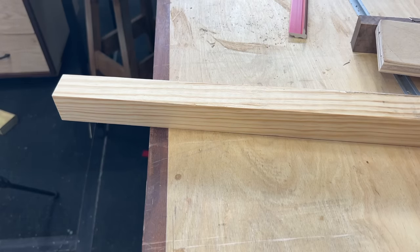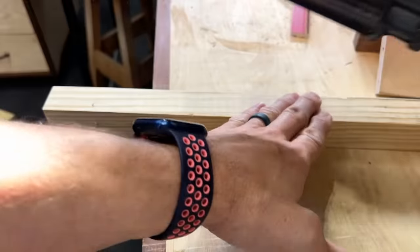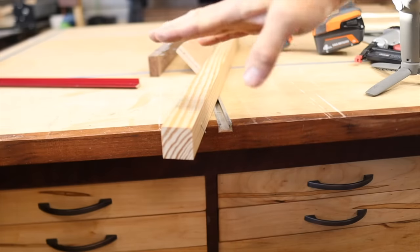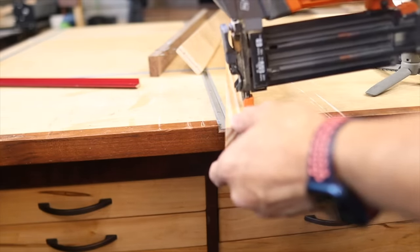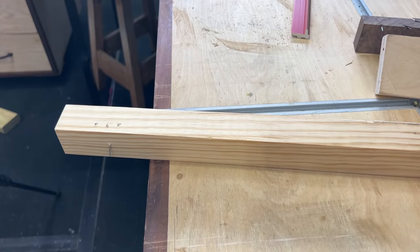So why is that important? The reason is if you're driving close to the edge of a piece of wood or trim, it can blast out the side. Why? Because that wedge, when it hits that wood grain, it's going to go right or left depending on how you're holding your gun. Now if you're holding it this way, it won't do that — it doesn't blow out. That's a good thing to keep in mind when you're driving brad nails.